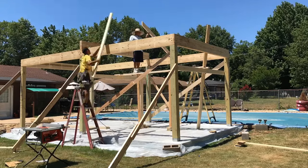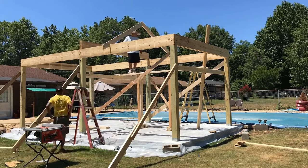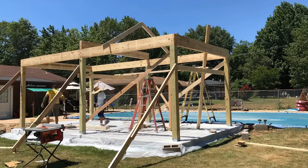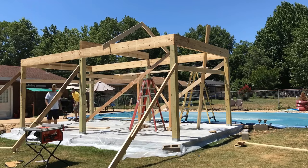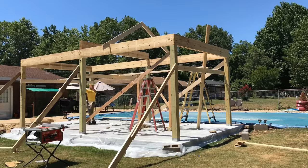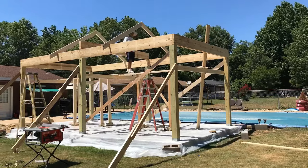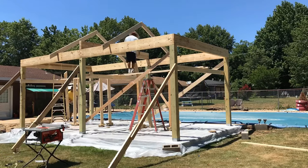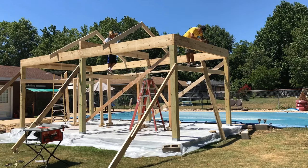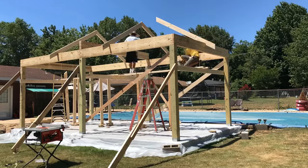We start with the rafters. To get the measurements of the rafters, I use an app. I will leave the name in the description, and you can check it out. It's a really great app that I used, and these rafters came out just perfect. On the rafters, we use 2x6s, which is a recommended one. Hips, and for the ridge, we will be using 2x8s, which are stronger because they're gonna be the ones holding the weight.